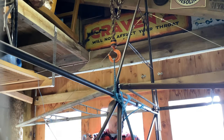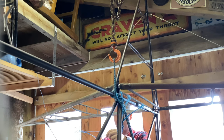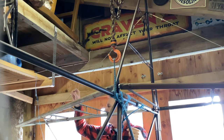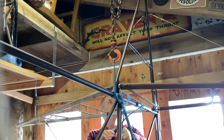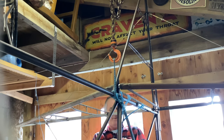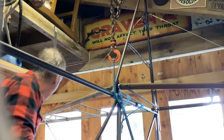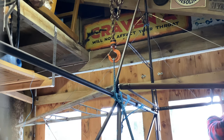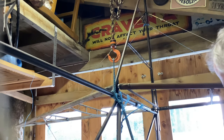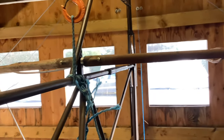I've had to shut the doors — all manner of stuff blowing in the shed including vast amounts of leaves. It's even windier than it was earlier, although quite nice and sunny as well. I want to swap these wires now. If I just take these wires off, particularly the top wires, the thing's going to collapse and the tail planes will collapse downwards and bend the bolts — a frightful mess. I've got some Air Ministry approved string here, so I'm going to replace the top wires with that. Then all the wires can come off and we can stick the streamline wires on with their cable tangs.